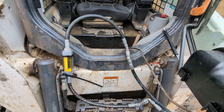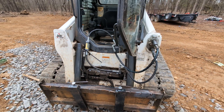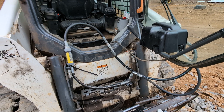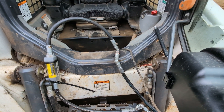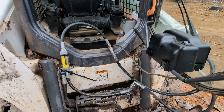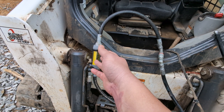We're not working on a tractor today. This is my skid steer, a T770. It's high flow, which we won't even need to get to. This machine has 24 gallons a minute at wide open throttle at standard flow, and something close to 38 gallons a minute in the high flow setting.